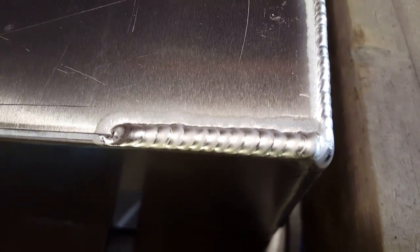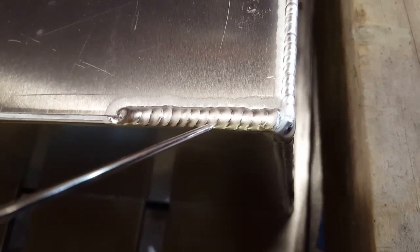And that's what that looks like. It's alright. The reason I don't use it — the reason I don't like it — is you can see a little bit of cloudiness, and on a transformer machine that's even worse. Because when you stop, that arc is doing the cleaning action, so that new metal that just solidified is getting cleaned, and then you're moving.